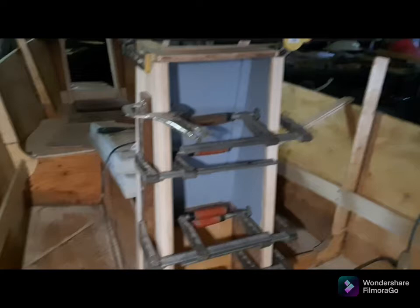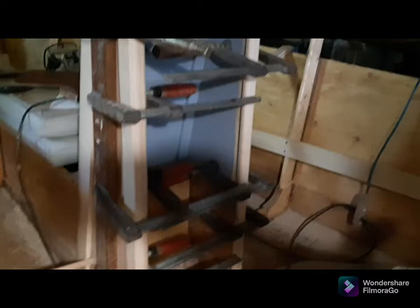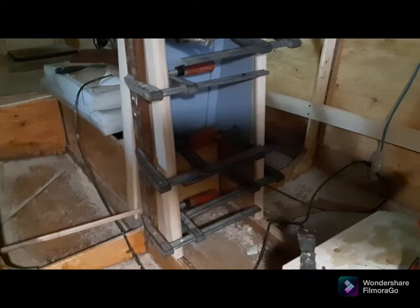There's the console glued up now. I pre-painted the top box and the lower section still has to get painted. You can see all the clamps because I've added 3/8 plywood all the way down to the base. The framing comes all the way up from the base so the console is really good and stiff — there's framing on the front, framing on the back, and down the sides.